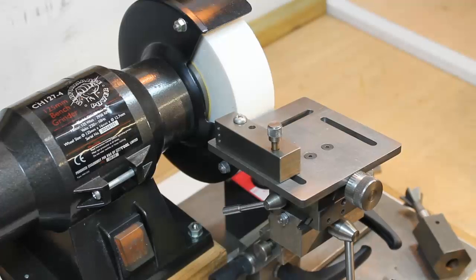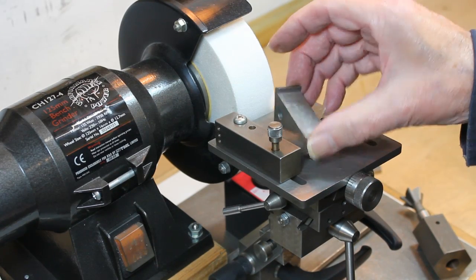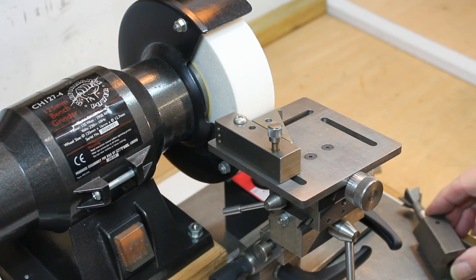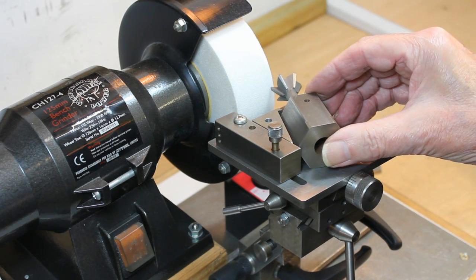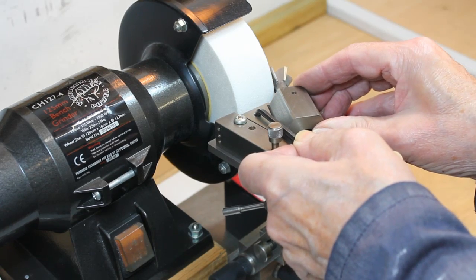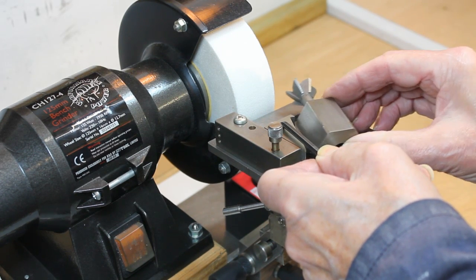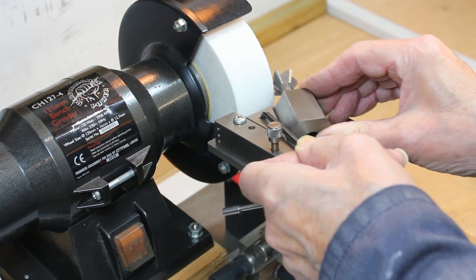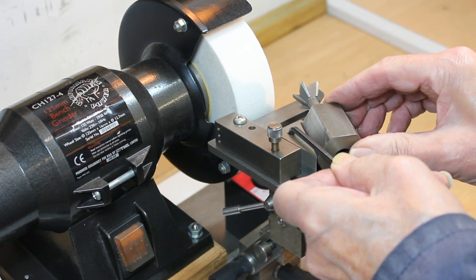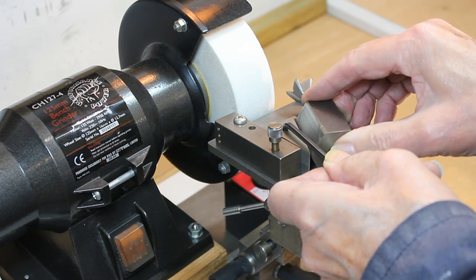For the end edges, we need just one additional accessory — a simple triangular item. The action to complete the task is with an Allen key in the hole in the triangular part. Apply a force attempting to pull it away from the wheel. However, with the cutter holder in one's hand, apply a force to move the cutter forward, and also a force sideways to keep the cutter holder against the triangular accessory and the accessory against the fence. A few test runs prior to actually grinding the cutter would be a good idea.